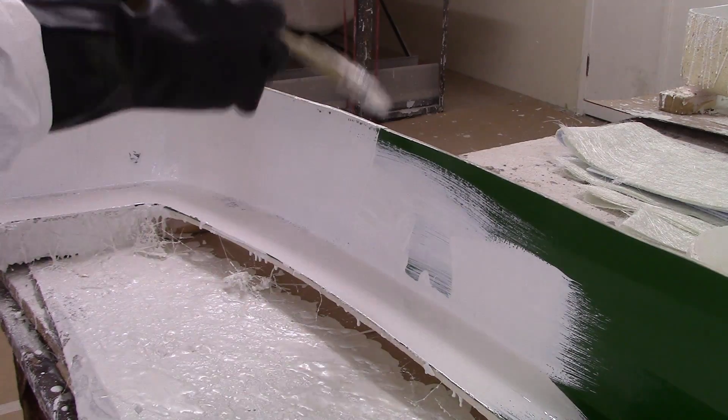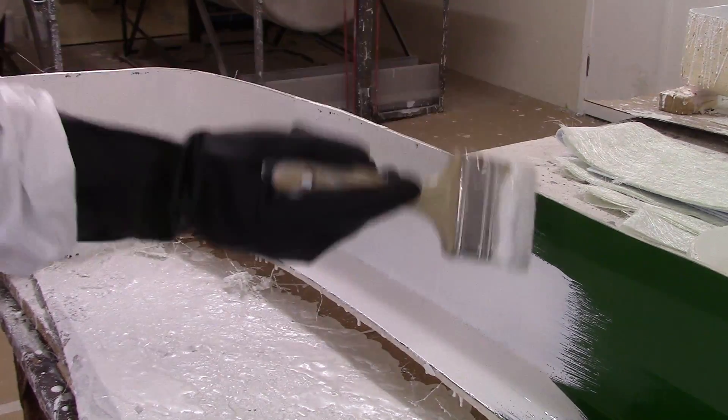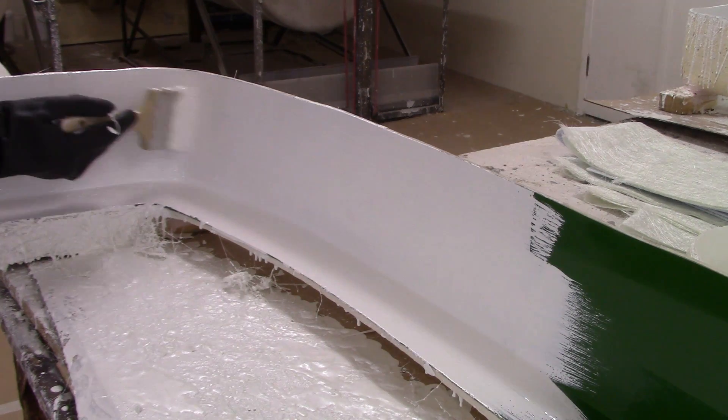In the mold you should get roughly about 1.6 square meters to the kilo. From that calculation, work out how much gel coat you need for your surface area, and make sure you've transferred the gel coat out of the bucket evenly across the area.